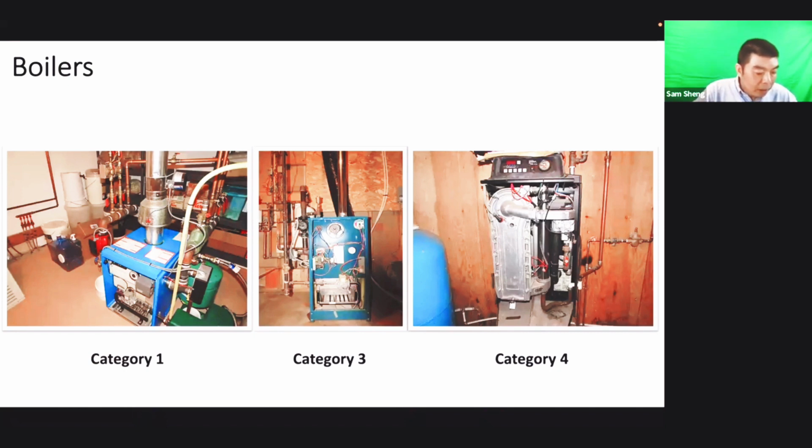And the pressure reducing valve, also called a pressure regulator or regulator valve. I cannot see it here, but we see the zone valve here. With the zone valve, the boiler is better than the furnace. It's easy to control the zones. For different rooms, we can put different water loops and use different zone valves. If we don't need a room, we can easily turn that room off. But a furnace is hard. Some new furnaces use a zone valve for every floor, but it costs lots of money.